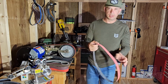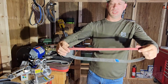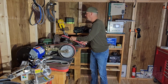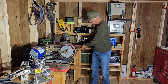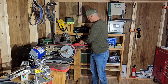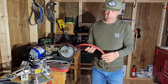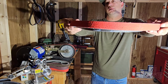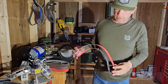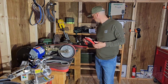They're the shredder belts. 1x42 size. This is the 120 grit. That shows you what they look like after they're wore down. Let me grab a newer one. Show you what these shredder belts look like. They're great belts. They work awesome. They're ceramic if you want to take off a lot of steel. So that's a close-up. Shows you the grit on it. We'll take a closer look. I'll bring the camera over where you can see everything a little bit better.